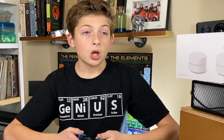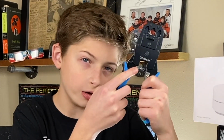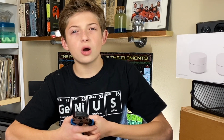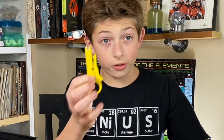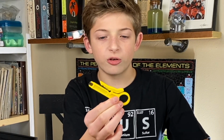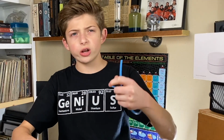By the way, our crimping tool has a built-in wire stripper, as you can see here. But the first few attempts using it, I nicked a few of the copper wires in the twisted pair and had to start over. This stripping tool is more delicate on the underlying wires and prevented this problem every time. First, strip about 1.5 inches of coating.